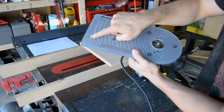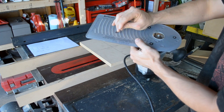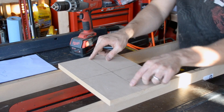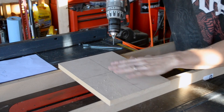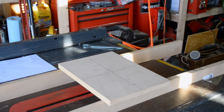All you do is work your way up: 1/16th, 1/8th, 3/16ths, a quarter — just match them up, put the pin in, and go with it. I've laid out a sample piece here to show you, and I'm doing a test piece for when I build a speaker box. I got my cross sections all drawn out. Take an eighth-inch drill bit, put it dead center, and drill down in there. I found it makes it a little hard to get out, so I open the hole just a hair — nothing crazy.